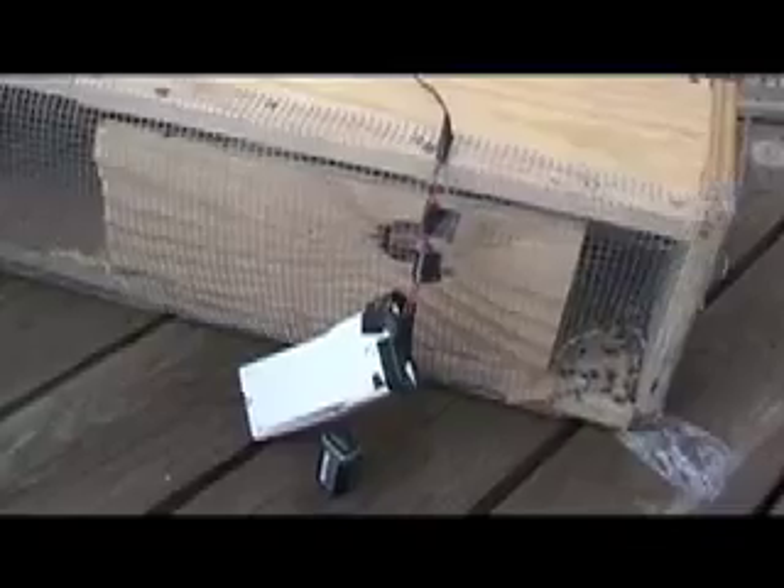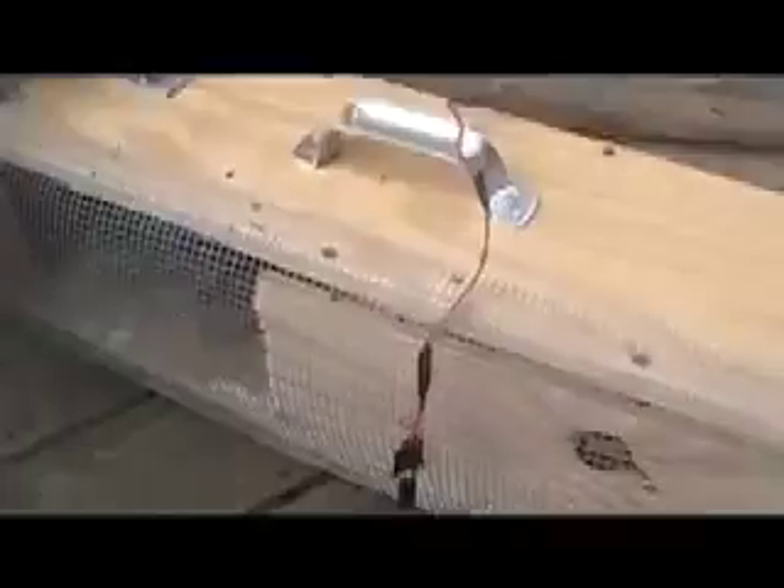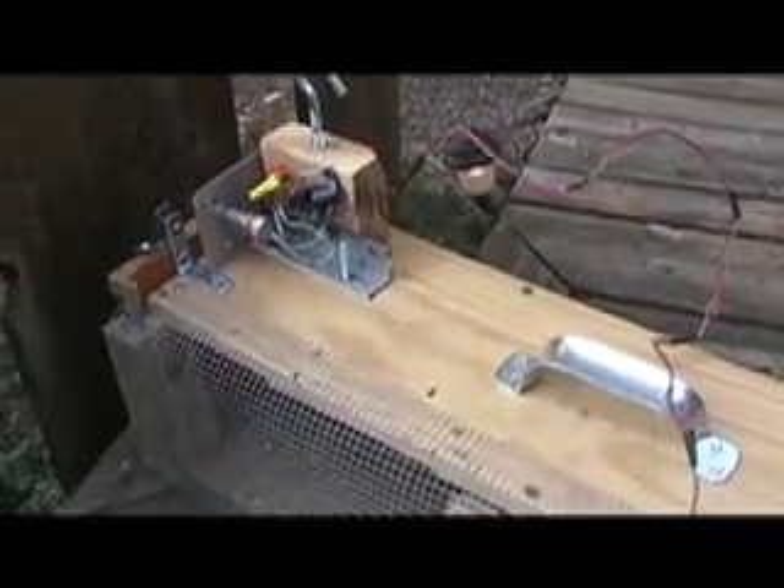Here's how this works. There's a motion detector here, which I place down at the end of the trap. When the motion detector detects something, there's an LED that lights up that pulls the voltage to 2.5 volts, which I soldered a wire from that to the base of an NPN transistor. The collector of the transistor is wired up to a latching solenoid, which is powered by the same 9-volt battery as the motion detector.